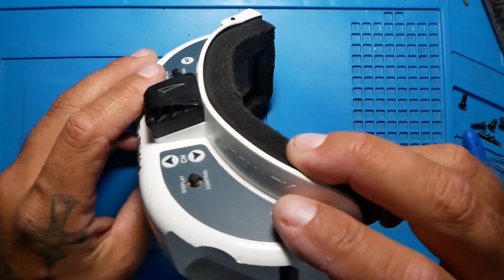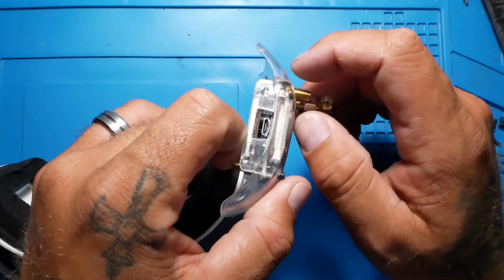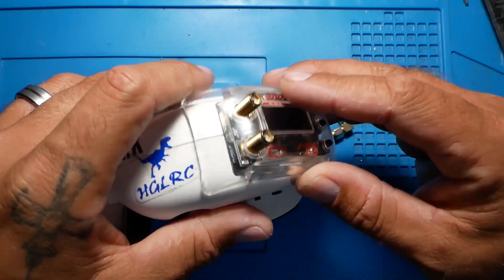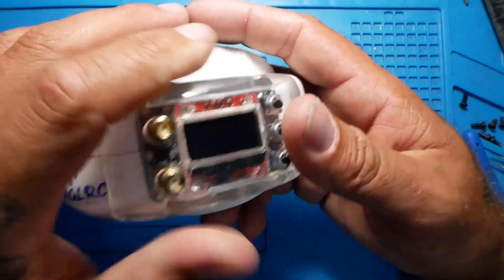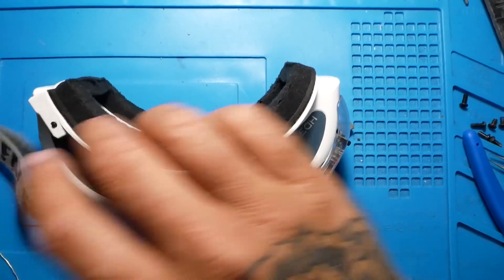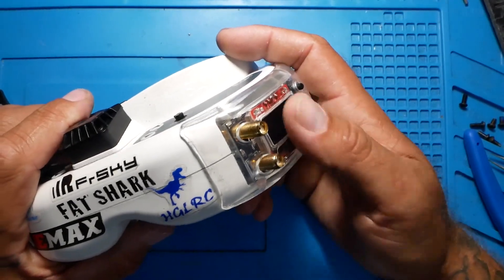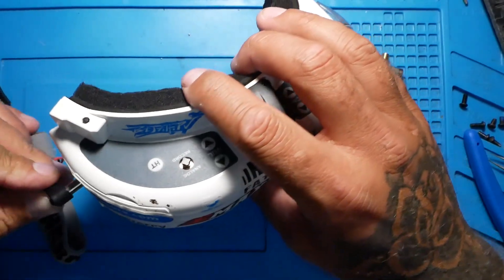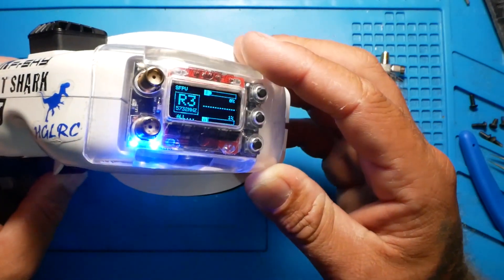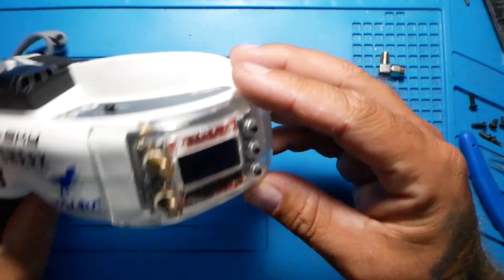So we now have goggles again. The only thing left to do is to put your new module in — you probably have a Rapid Fire or TrueDX, doesn't matter. Go ahead and pop that in. Be careful on the pins. After you pop that in, go ahead and plug in power. When you plug in power and this pops up, go over to your voltage and see what you're getting. Make sure that you're getting the voltage that you need — you don't want it locking you out because you're not getting enough voltage. Voila. I want to thank you for tuning in. Go ahead, hit the like, subscribe — don't if you don't, do if you do. Thanks for tuning in, I'll see you on the next one.